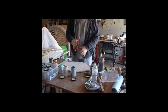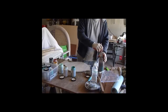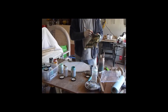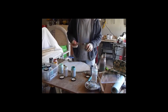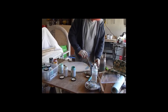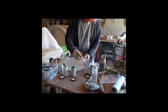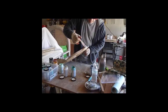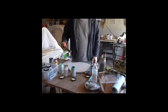Okay, all set. I have my paint here — they're all chalk paints. I'm going to use a bunch of different colors because that's what I do. This is not fine art; in fact, you may see me dip my brush from one color into another without washing out the brush. What I'll do is paint, then wait for it to dry, sand it, and put a finish coat of wax on it. The wax will seal the chalk paint and make it look real vintage.